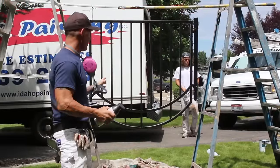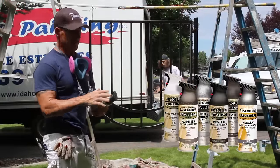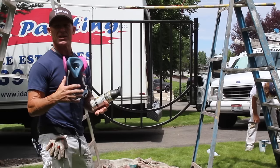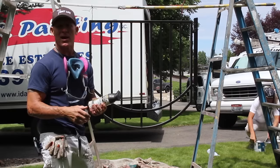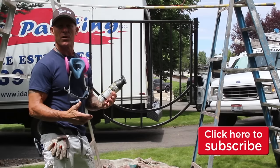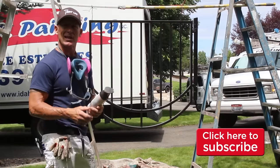So a few tips when you're actually spraying this gate with spray cans: watch that I'm not actually releasing the trigger on the spray can, because it will cause spits. This is a metallic finish and you want it to gel out, not have spits — just a continuous spray. Your gate will look a lot better and you won't have dry feathers or overlap marks. I'm trying to spray it all continuously to get it to gel out.